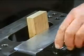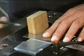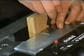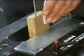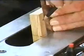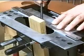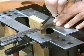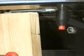Sliding the top plate towards you will assist in marking the compound shoulder line around the timber. Bisect both edges and mark the waist for the tenon shoulders. Use a square to run verticals up from the edge marks and the shoulder marks. Move the top plate away and measure up from the shoulder line the finished length of the tenon. Mark and then lower in the jig until the mark is flush with your rule. Mark a side and face, then remove from the jig and saw just clear of the line with a tenon or chop saw.